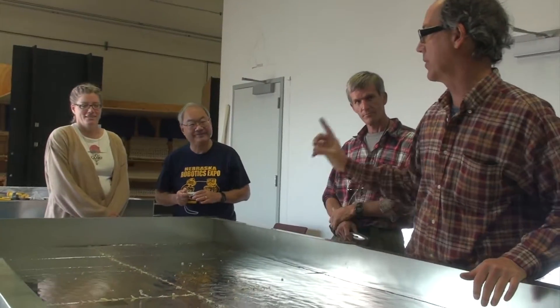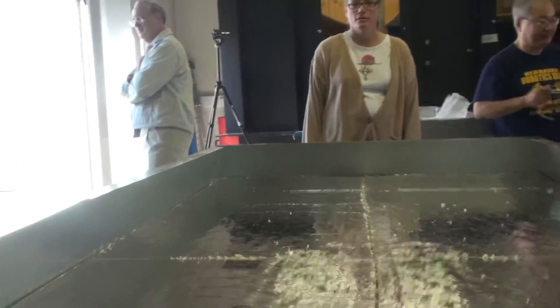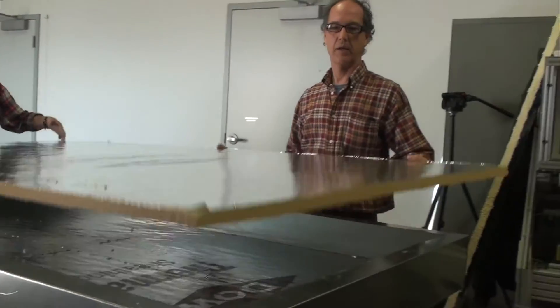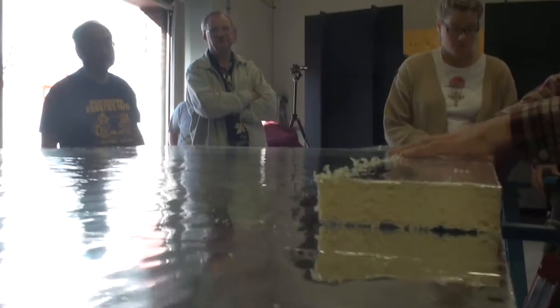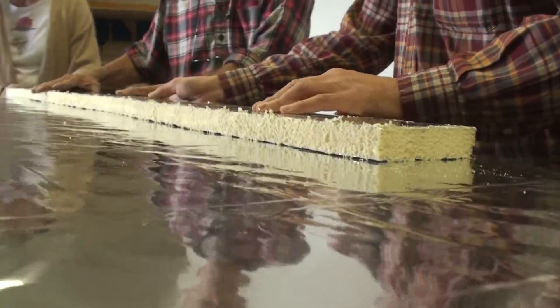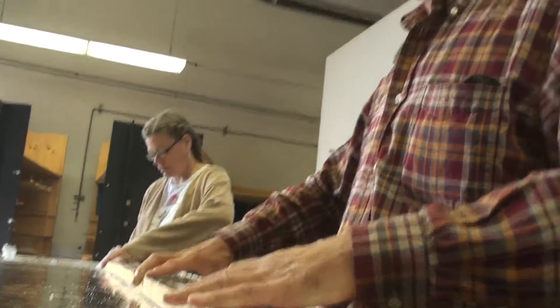We'll just work on one more piece to go on top of this, and then we'll start working on the side. What we did last time was we scored it and measured it by hand. This time we'll take the pieces we had left over and use them as our template. Because we were a little bit short on the last one, we want it all the way to the corner — so you square it up. This has got a factory edge to it, so we'll use the factory edge on the outside. Let me flip it over and use the factory edge because it's easier to measure on the outside. Then we need something to score it with.